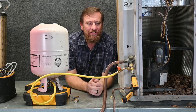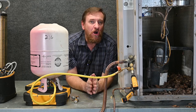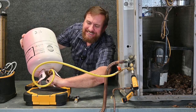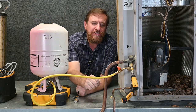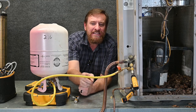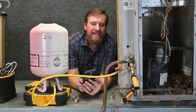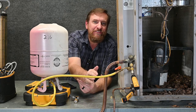It's very easy to add refrigerant this way — simply open and close that connection. When I'm almost done charging, I do something a little different: I close off my tank entirely. I still have liquid refrigerant in the hose, so I keep giving it little shots until all the liquid refrigerant has gone out of this hose. Eventually I can leave this valve completely open, and I look at my app to see that the pressure is not changing at all — that way I know all the liquid is out of this hose.